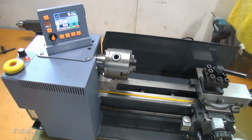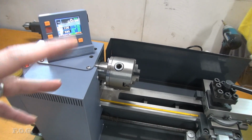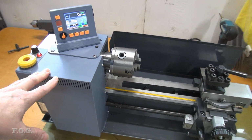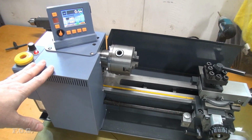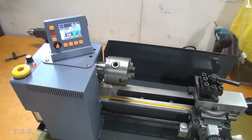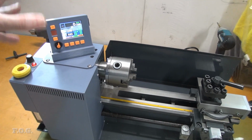It's much better that way, and it's easier to maintain. If the board blows, I can easily pop that board off and plug it back in, as opposed to trying to deal with that Frankenstein monstrosity that I had. But even so, in the future, I'm really thinking seriously about having to rebuild or build my own, or design my own speed controller, and I really want to build one with a sensored base arrangement, so that we don't have to have all of this sort of jumpiness.